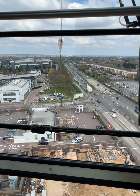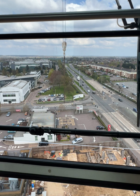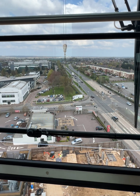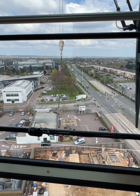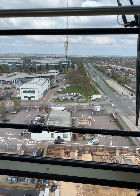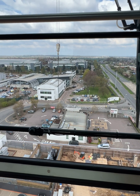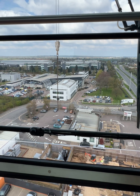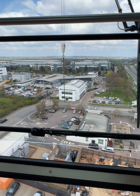There's also what you call back notching, depending on the configuration of the crane. The idea is: for every action there is an equal and opposite reaction. Say I slewed to the right in first gear and created a swing and motion in second gear — there will definitely be an equal and opposite reaction when I stop. The velocity is still moving forward, so you catch it with second gear, because you moved to that direction in second gear. And there you go — you catch it bang on with no swing.